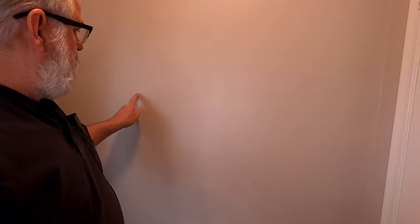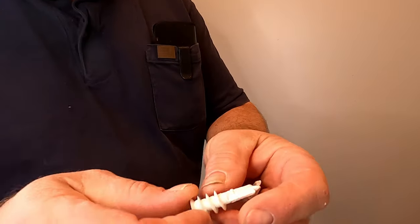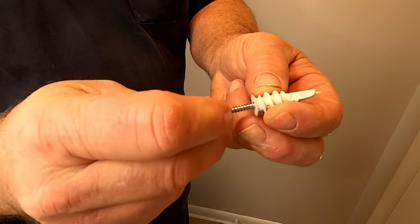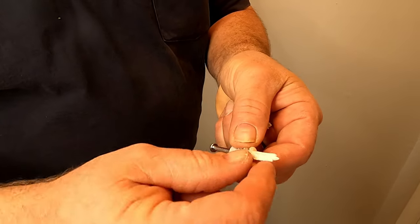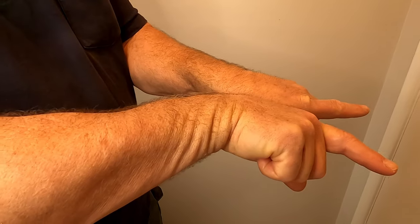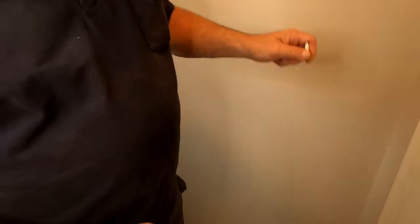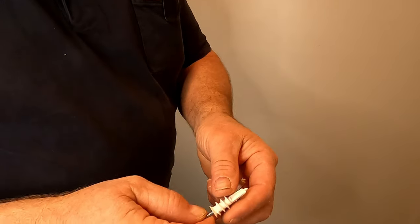Now the way this works — I'm going to measure where my holes are going to go, and then I install these anchors in the drywall. They've got this very coarse thread that holds it in the drywall. When the screw goes into this anchor, as it goes in, it's going to open this anchor up. It will snap and open up like that inside the wall, and that's what holds it. It's actually a very strong anchor for shear, which is pulling down, and it's rated for 75 pounds — more than enough to hang coats or a purse on.